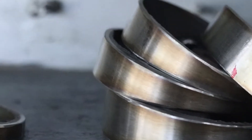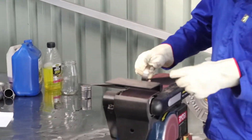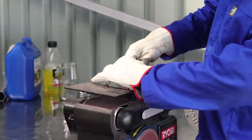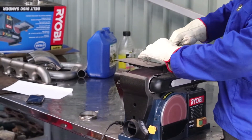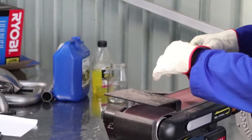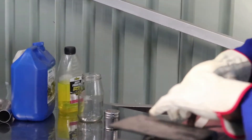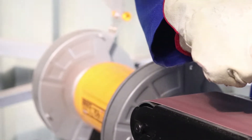You're going to notice that I've done five-degree cuts, which means each one of these cuts is actually 10 degrees. The whole point is to make a 70-degree bend. I might want to transition going up as well, since I saw that the original pipe bends at 70 degrees then goes up and down. So I need a few more cuts to follow that exactly. I'll test during fitting to see if it really requires that — there might not be any need to do so.